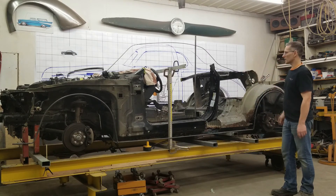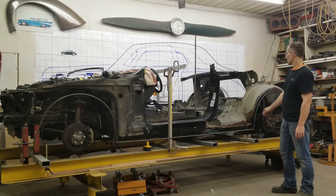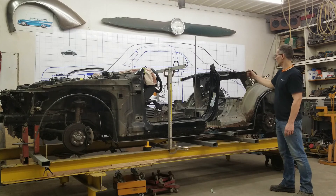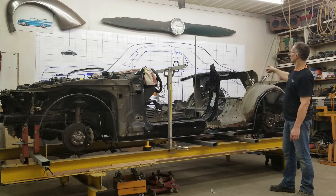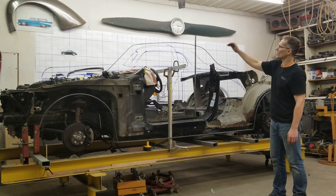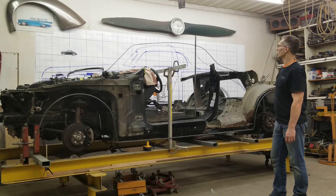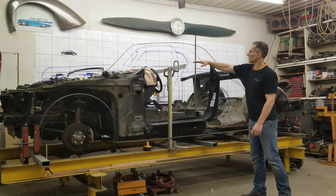This rear deck will work the way it is, except we have to move it ahead a bit to correspond with the rear window. There's not enough material in this section, so once these webs go in, we'll be able to move that ahead and just fix it to those webs a little easier later on. The silhouette of the roofline is in — you can see that nice, gentle sweeping curve downward towards the glass. It's really starting to take shape. Next time we're going to get the shoulder line in place and get this door line established here. Thanks a lot for watching. Take care.